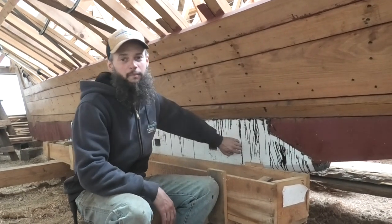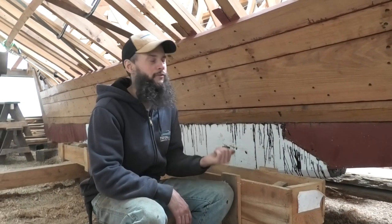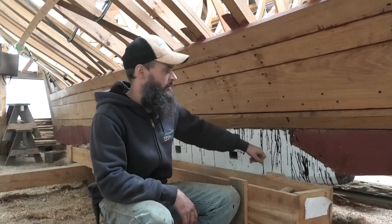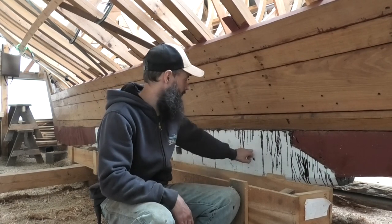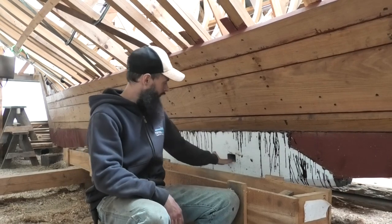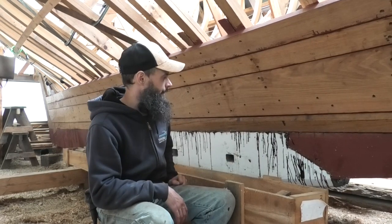This is our four and a half ton lead ballast keel — that was our first really huge hurdle. Everything from two-ounce battery terminals that friends dropped off, up to three or four different sailboat keels went into it, plus a few thousand pounds of wheel weights. We melted it all down in a 200-gallon air compressor tank with a roaring fire around it, then dumped almost a hundred gallons of molten lead into a wooden mold buried in the ground. Out came our ballast keel. It's held onto our wood keel with one-inch bronze pocket bolts that go through the lead and lock it on.